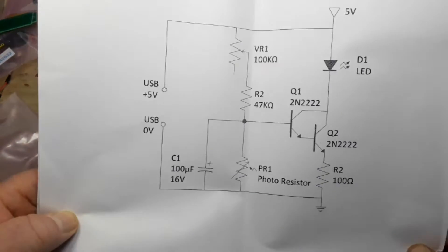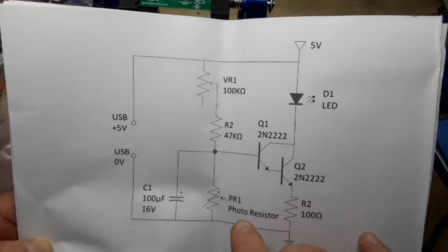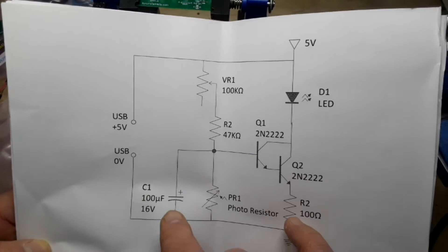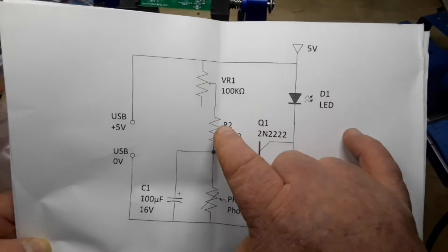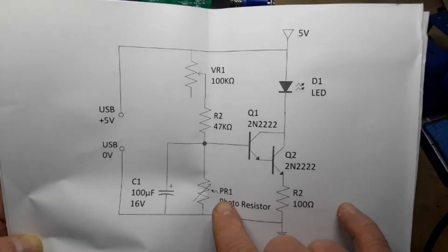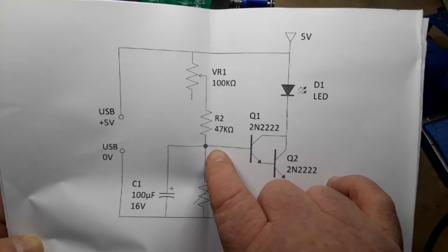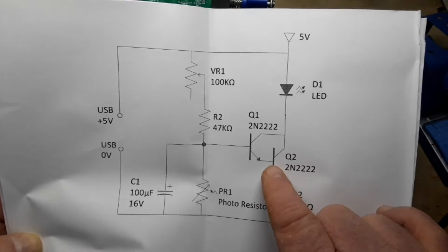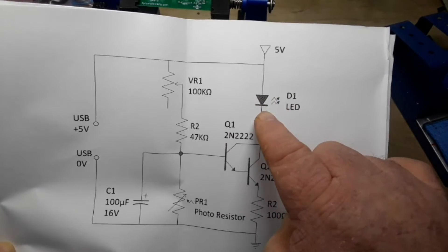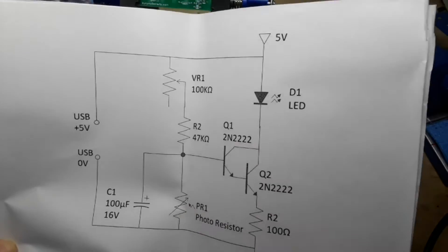We're going to start out with the nightlight kit. Mr. Byram is an engineering teacher in Salt Lake City, Utah. Here's the schematic he sent us. We have power coming in over here — you can do it through USB. Then it comes to a variable resistor through a resistive divider consisting of a 47K resistor and photoresistor PR1. That splitter is going to split the voltage coming in and power up this Darlington pair of 2N2222 transistors. When they begin to conduct, they will draw VCC down through that LED and power it up, depending on how much light hits that light sensor.